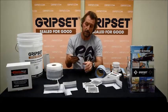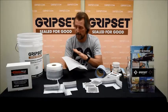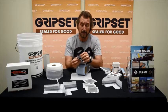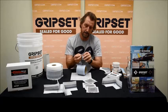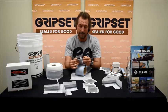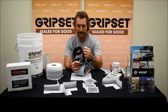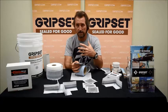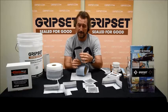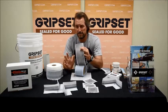We have our butyl squares, used emphatically over puddle flanges — we'll have a separate episode just on flanges and drains. We have butyl flashing in a couple of sizes: 80mm and 150mm wide, and even a one-metre wide sheet. The beauty of butyl compared to bitumen is that butyl has very high adhesion and high tack but it doesn't bleed. With peel-and-stick bitumen membranes, in heat you get sliding and yellowing as solvents evaporate and bitumen softens, but this product's softening point is far higher — roughly minus 20°C to 90°C without issues.